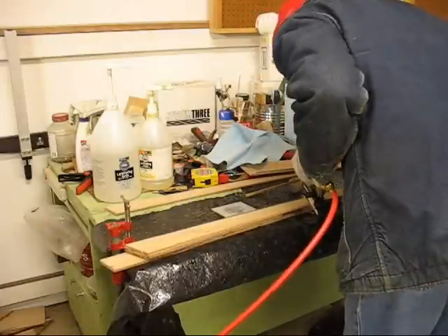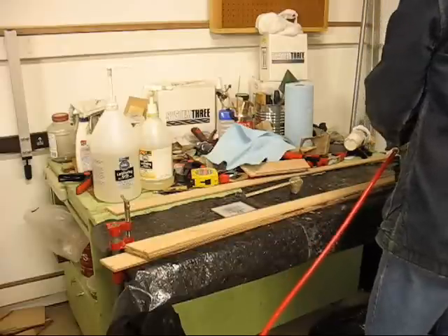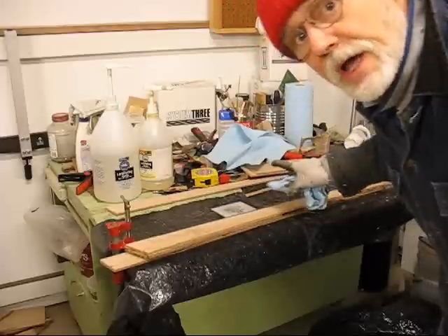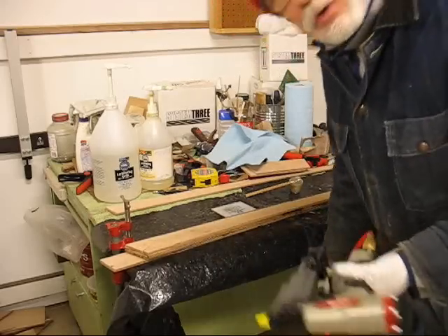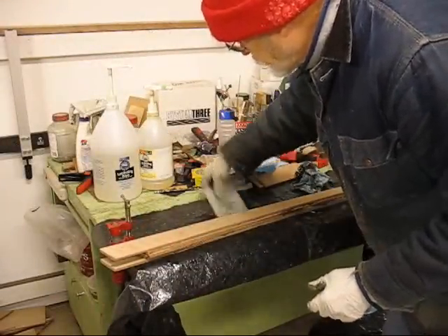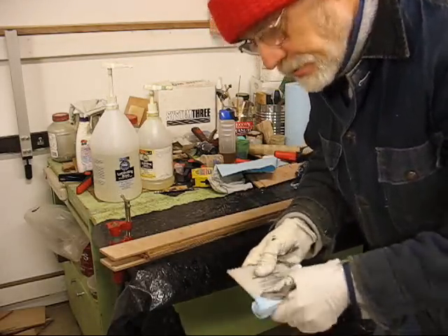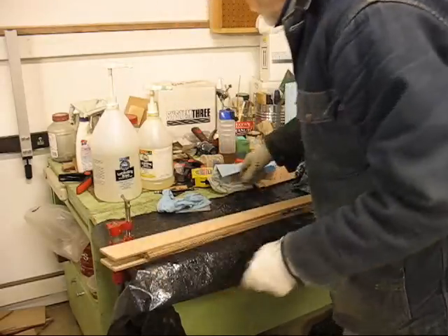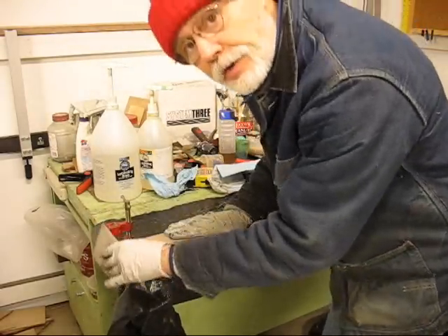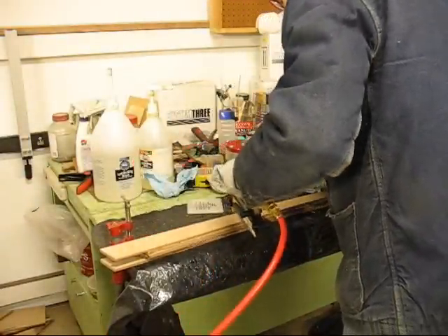Stack-wise, make sure the final little trim down will be even and you're not going to have a hole in the middle that you've got to either fill up or trim down to make it a lot thinner. If the sides are a little thin that's fine, but you don't want the middle to come up short. We have the top one on, it's all buttered down. As long as the serrated tool leaves nice little ridges behind, you have enough on there to spread out when you compress the two pieces. Make certain it's lined up — this one is going to be the crux because these are critical distances here.